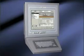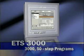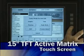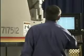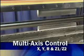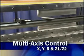The most advanced system is the ETS 3000, a powerful multi-axes controller. Information is displayed on a pendant-mounted TFT screen. The 3000 is loaded with the same features as the 2000, plus a graphical display for bend simulation with tool overload and interference checking. In addition to the X and Y axes, you can add the R vertical back gauge axis and the Z1, Z2 horizontal finger positioning axes.